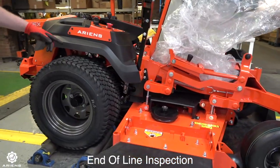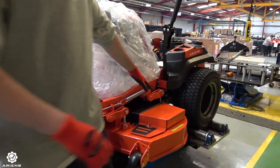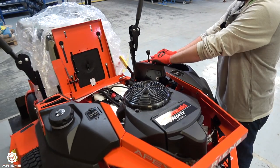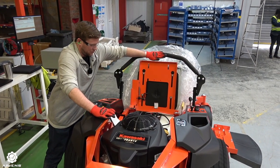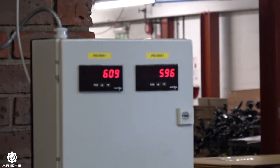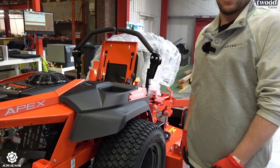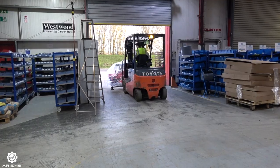When we get to the end of line inspection, all the different components that have been installed are double checked for quality assurance — making sure that all the stickers and decals are in place. The wheels are inspected to make sure it's the right wheel for the right mower. The safety switch is put on so that the mower can be checked to see how it operates without somebody sitting on it. The throttle is turned up and the drive systems are inspected to see how they perform. They double check with a reading on the panel screen to see how each drive is driving. The handbrake is applied, the engine is turned off, and that's it — it gets wrapped up and put on a pallet, ready for shipping out to a new dealership. And that is how a zero-turn mower is made.